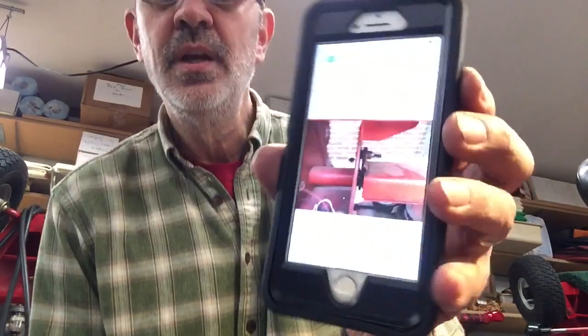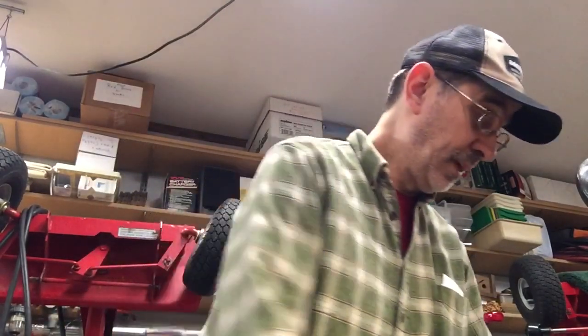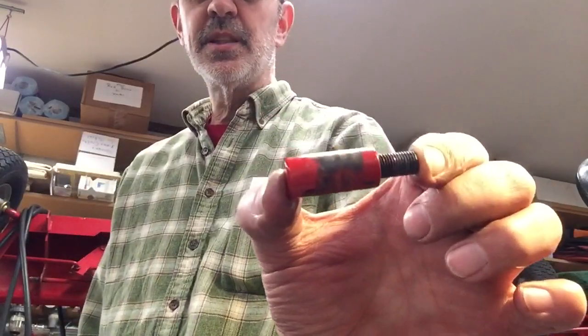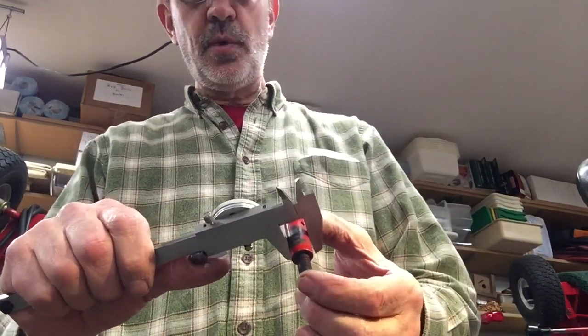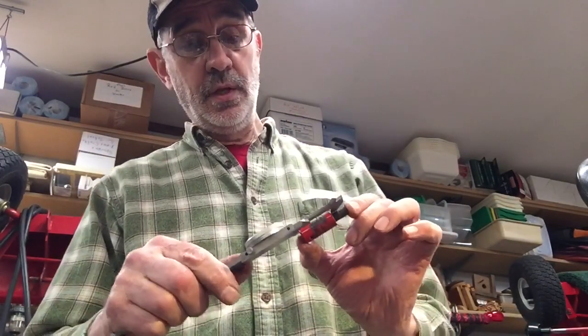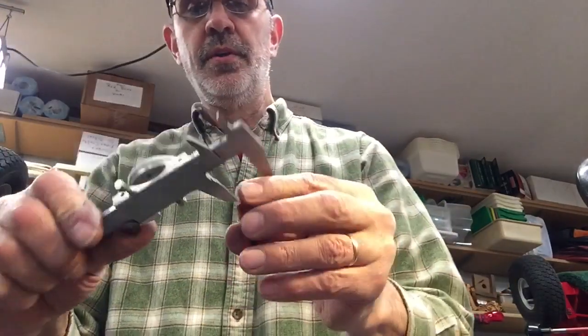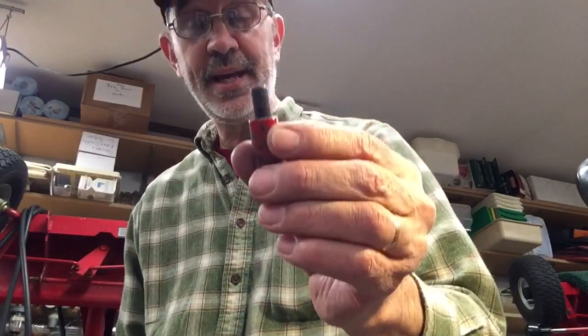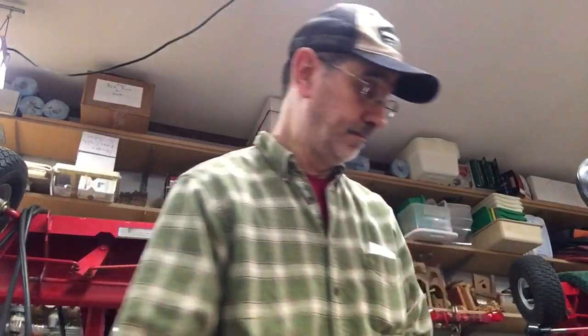I can see why from the pictures he sent me. There's a bolt that goes between the rear case and the front assembly that's supposed to keep the belt tight. Larson, somebody's been in there and changed some parts, because this is what you're supposed to have — it's more of a pin than a bolt. It's 0.625, so it's 5/8-inch diameter and 1-3/8 inches long just for the pin part. This is a 3/8 fine thread, and that part is 0.625, so that's 5/8 long.